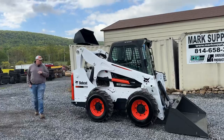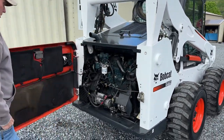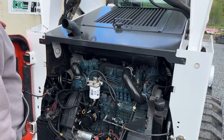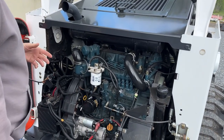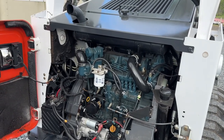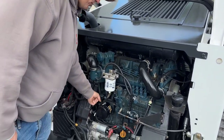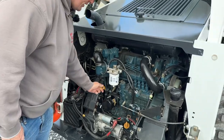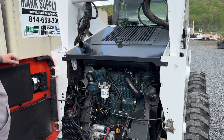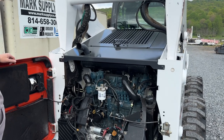It has a Kubota motor in it. Come on back — we're going to start you around this machine. Back door is in excellent shape, very nice and straight. We did paint the back door. Again, powered by a Kubota — it's a V3800T. These are a 92-horsepower machine. I'm sure there'll be someone out there saying it has an EGR valve — yes, it does. We've done nothing to them. I still classify these as a non-emissions machine because they still have black smoke coming out of the exhaust pipe. There's no DPF, no urea, none of that. We did do a full service: all filters and oils have been changed — engine oil, fuel, air. There is a hydraulic filter up here in the tank. The charge fan filter has been changed. Cabin filters are brand new. We went through this thing thoroughly — it's a very good running old working machine.